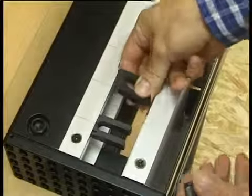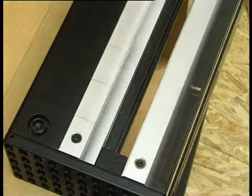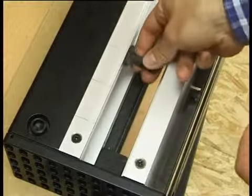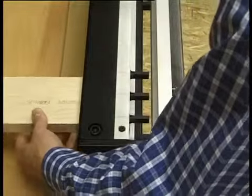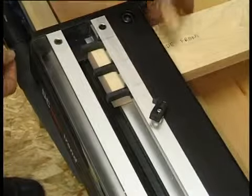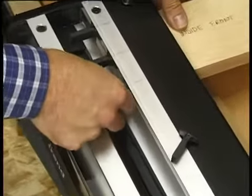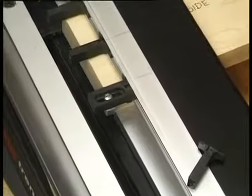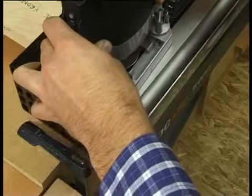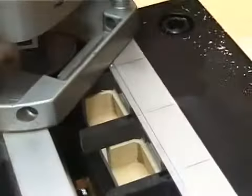Replace the tail guides with the lapped pin guides. The pencil marks will ensure that the pins will be in exactly the correct position — straight away the offset is correct. For the pins, mount the timber in the horizontal clamp with the distance forward of the rear guide set by the thickness of the side just cut. Or use the lap pin stops. Again route left to right, taking gradual passes, removing a little more material each time.